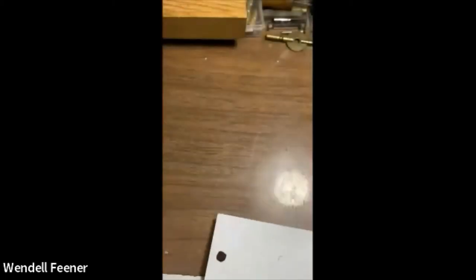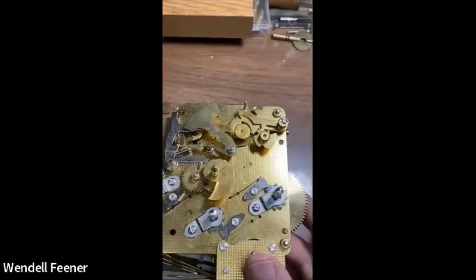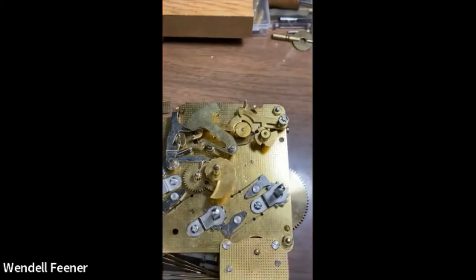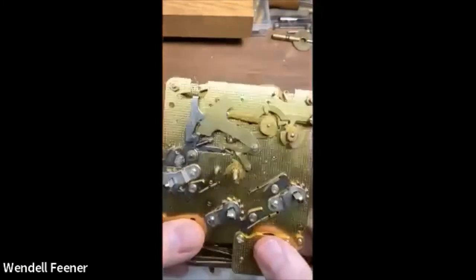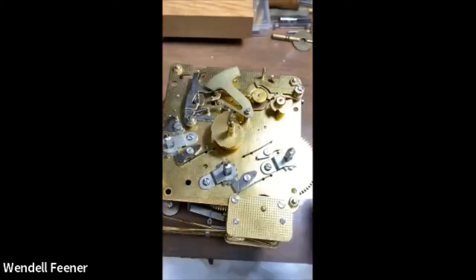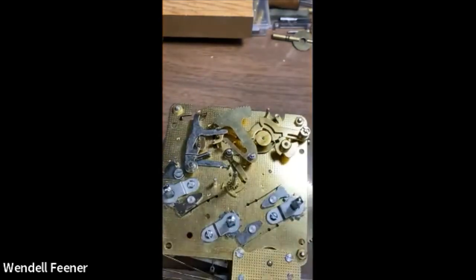Now that you understand how the snail interacts, it makes it easier to put things back together. The first few movements I took apart, I tried to mark teeth to go back exactly the same way, but it never worked out. It's simple to put it back after we're done. Now let's talk rack and snail. I'll stick the snail on so it won't drop. Let's talk about how to set that up while it's fresh in our mind — remember, there are four lobes.